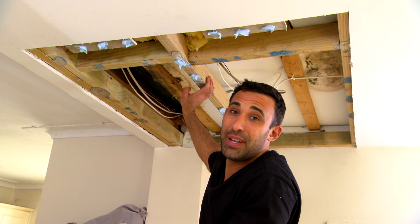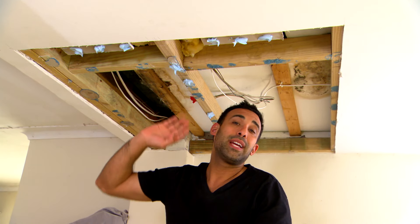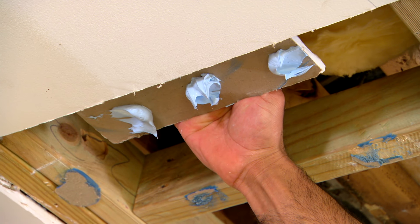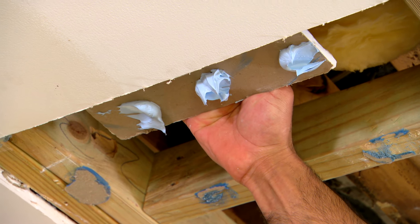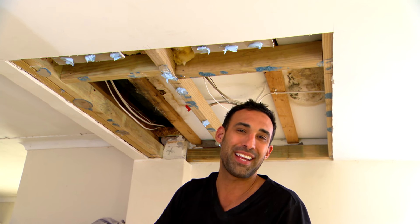The middle joist is the only one that gets glue on it. In between the joists we need to put a back block. Well it's just a bit of plaster with some studded pieces on it. What that does is it joins the two sheets together in between the joist and it will prevent it from cracking in the future.